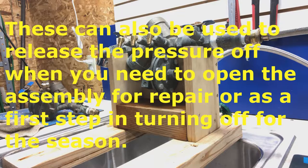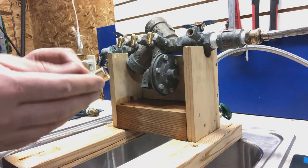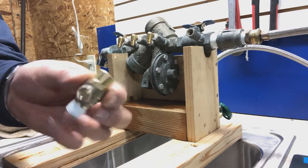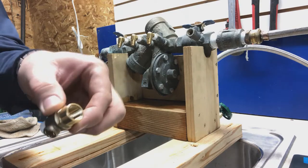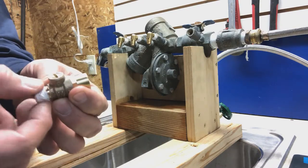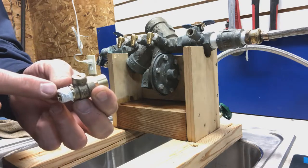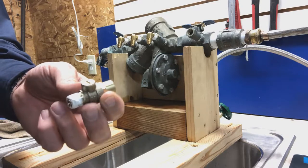They'll look a little different from model to model, and from years ago they've changed too. Some of you may see a test cock that looks something like this — it'll have a screwdriver slot in it. Some of the older ones had a little ball valve handle. It's just a quarter female fitting here with a male fitting on this end. Generally it's an eighth inch for the one inch and smaller, and for inch and a quarter to two inch, it's a quarter inch male fitting.